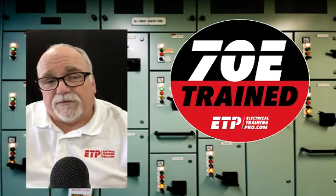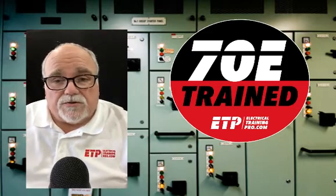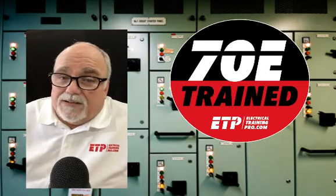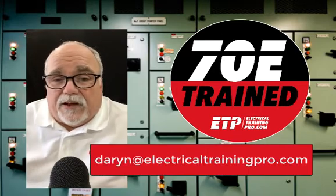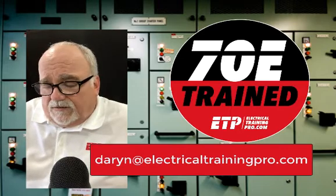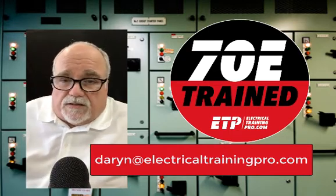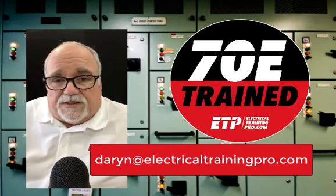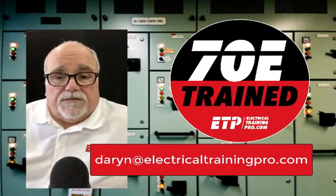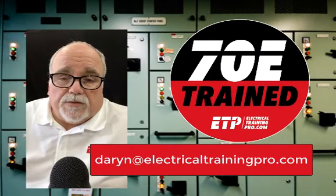If you're a safety professional, it's your job to keep people from stacking stuff in front of electrical enclosures. Maybe this gives you some ammunition to convince people there's a real reason why we don't want stuff in front of there — and it's not just because maintenance people want convenient access. There's a safety reason: we need to turn panels off in an emergency, and if there is an arc flash or something, we need to be able to get out of there. This is one of those OSHA things that an inspector can easily spot and it can cost the company money. More importantly, it's safety — we need access to those panels and we need to be able to get in and out in case of an emergency.